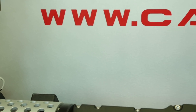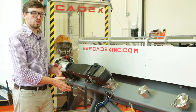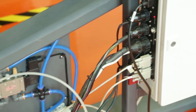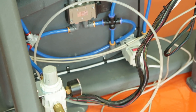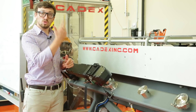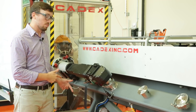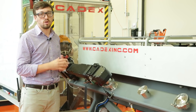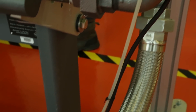My name is Davis Farrell. I'm a PhD student here in the Department of Bioengineering. I'm here today to show you a little bit about our linear impactor. What we have here is our computer, which basically controls this entire system. All these cords that look like a chemistry lab — it's just an organization of our compressed air and power. We have the source from our air and power that comes from the ceiling, and it all feeds down to a computer that tells the system how much air and pressure we're going to want for each impact. Here we have the tank that holds all of our compressed air for each impact.